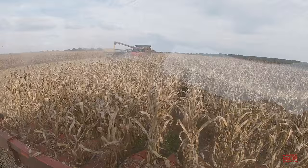So one of the things the farm does is you're trying to do a lot more controlled traffic and strip till, so everything's going 40 feet: 16-row planters, 16-row strip till, 16-row corn head. That is correct. There's a lot of advantage to that. Everything's staying on the controlled traffic. We're keeping that compaction, all those multiple trips we're making, in one spot.